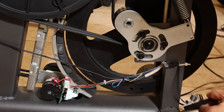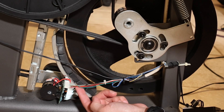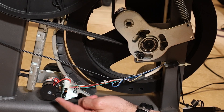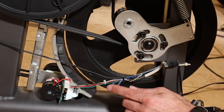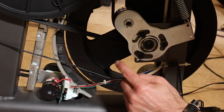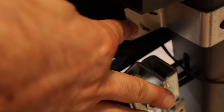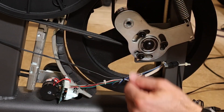This is the power coming in from the jack. On this connector we have red, black, brown, and orange. These four are for these sensors, so you've got power and then you've got signal outputs. That's what's going to tell the controller whether the brake is fully home, and every time the motor makes a revolution. There's one more signal coming in, which is this — connected to a reed switch on the other side, and there's a magnet on the crank. So that's going to tell you how fast you're pedaling when it displays the RPM.